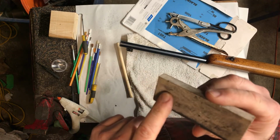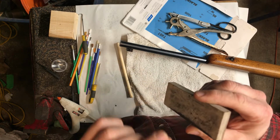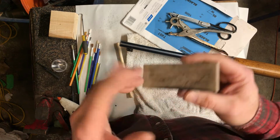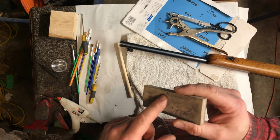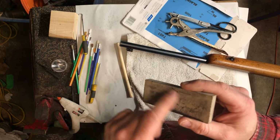What we're actually going to use this for is to dull up the sandpaper so it doesn't have such sharp 1500 grit. Now you could say, well, you could use 2500 grit. You have to use almost used sandpaper in my experience. So you could use finer and finer, but even if it was new 2500 grit, I would still recommend that you roughed it up.